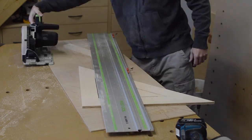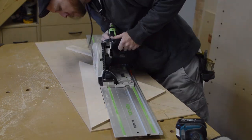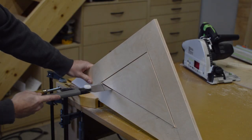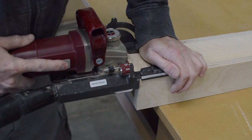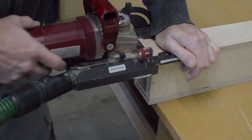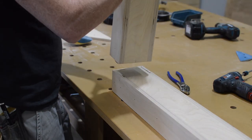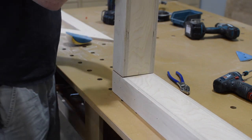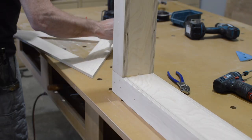And the side braces I decided to just cut out of one piece of wood. That simplified construction a little. And I wanted to hollow out this middle section because that's where the 4-inch dust collection hose is going to go through there. I went with a butt joint and some biscuits on this one versus that sleeve setup that I had on the first version. This was faster, and I think after gluing on the side triangles, both joints were equally strong.